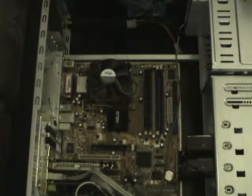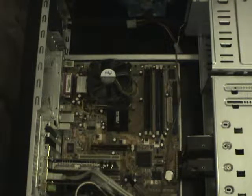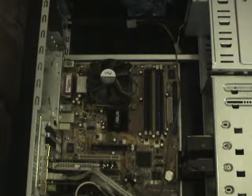As you've seen in our previous segment, we have the voltages going up and down. With a good power supply, the voltages are going to be more stable than you saw in that BIOS and are not going to sway very much up and back, because the more sway you have, the more the parts have to try to adjust, and too much sway means you could get too much voltage or too little voltage, and that can affect your RAM, your CPU, your north bridge, anything in the computer, whether it be hard drive, doesn't matter.